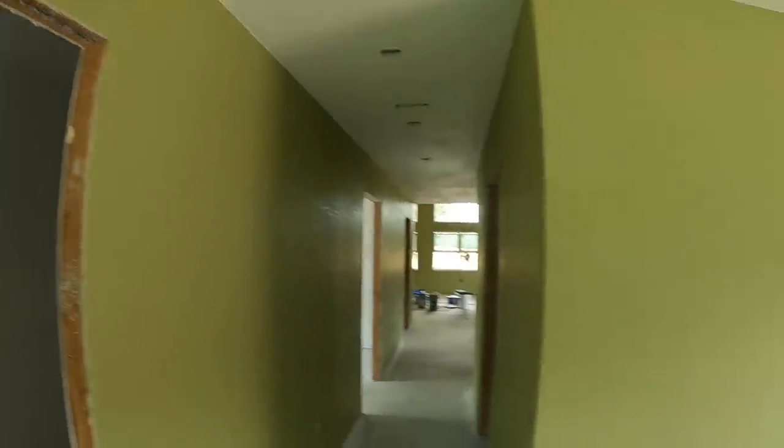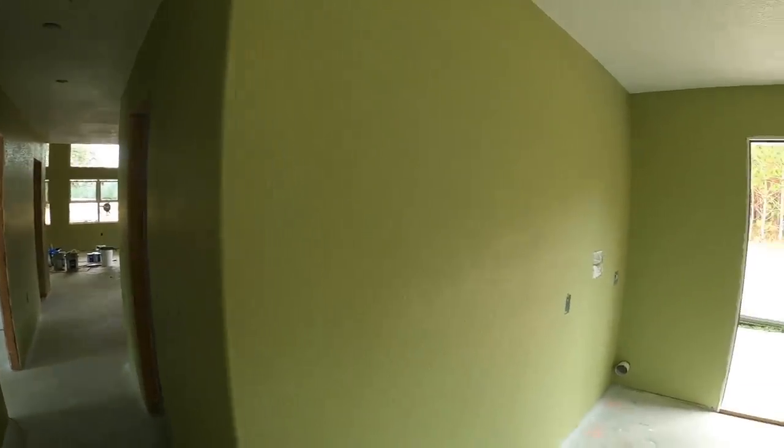It looks really good. But we had a big conversation about priming, how to prep walls. People talked about spraying and back rolling, all kinds of stuff. So the rolling has been very slow, but it's given me the exact results that I'm looking for. One coat of paint. I bought an extremely thick, very expensive paint from Sherwin-Williams that says it's a one coat paint and primer. I've got those results rolling.